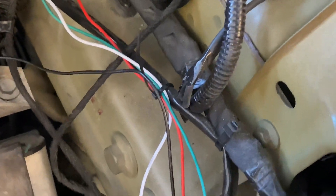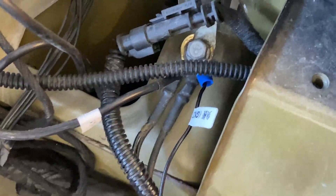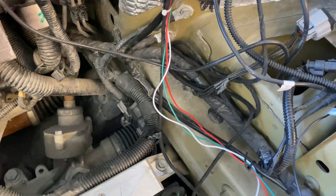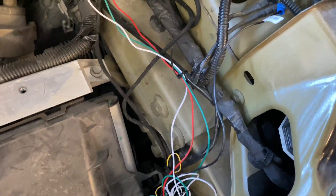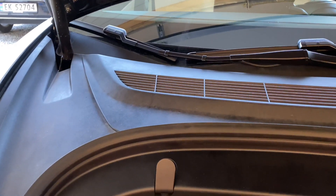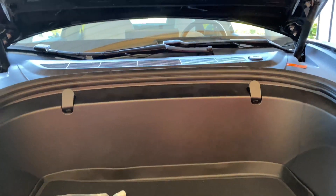All we have to do now is connect the negative — ground is connected to the ground point here — and everything is wired up. We've got a control unit in here, the positive here, the white wire going out to the terminal on the emergency release, and the wire going down to the sensor. Finishing up, just put everything back in place — I'll link to the other video that shows you how to take this out and put it back in — and it should all be working.